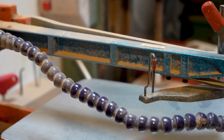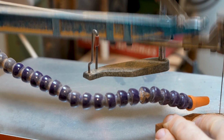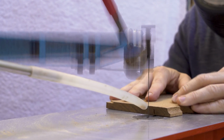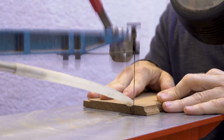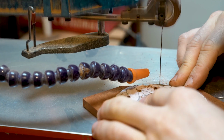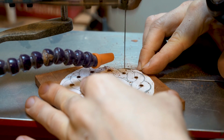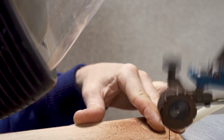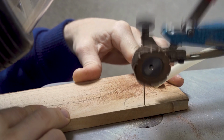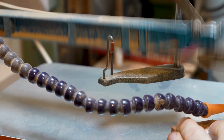The more modern version of the Multicut 2S has a purple hose for clearing the line of view. The earlier versions have a clear hose. Using a bellows on the back, it blows the dust to keep your line of sight clear. The purple, newer design I find more effective than the older design because it blows the dust away from you. I'm still working with the older design on our one scroll saw, and I always use the mask because it blows the dust into your face. But that newer design, they've changed it and improved the way the dust is removed.